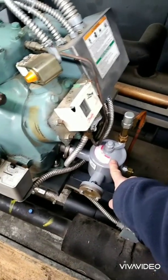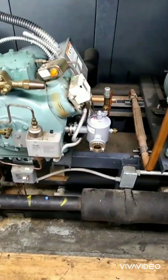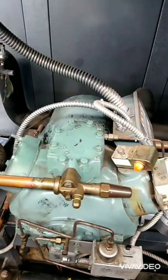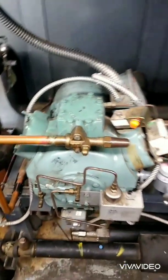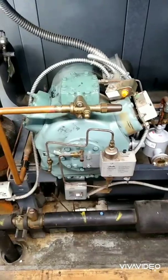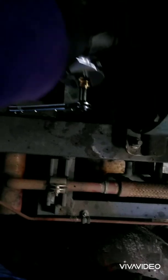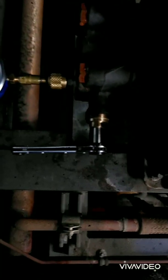I occasionally still have problems with this one cutting out. That's a new oil pot and a new oil level control. So I'm going to pull this compressor apart — pump it down and open her up just to inspect it. I've got my gauge on. I'm going to pump it down and just loosen the packing before I try to turn it, and then run it in.